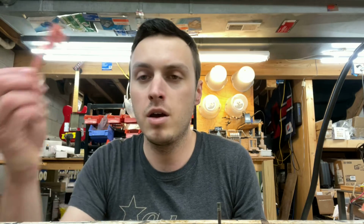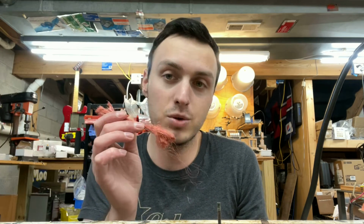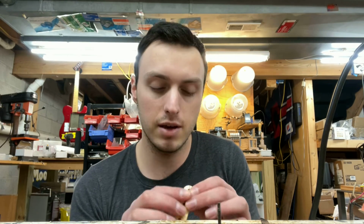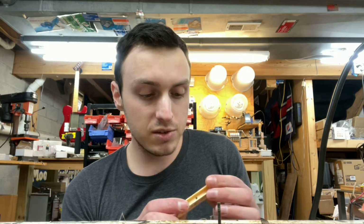This one, the bridge pickup, was around 13K originally, 12 or 13 I would guess, because we have 43 gauge poly in this one, whereas the neck pickup had plain enamel. And this one was wax potted as well. The neck was not. And maybe that's part of the reason why this coil still worked, is because the windings were waxed, whereas they weren't on the neck, and the neck pickup was dead. But still, we got to fix this.